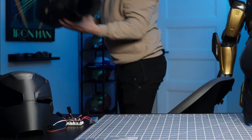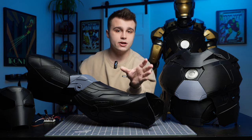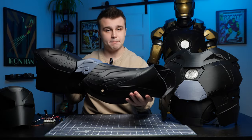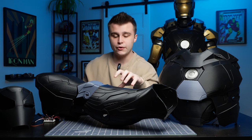The shoe covers have pretty much stayed the same since the last video, but the legs have changed quite a bit. The hinge that attaches the shin to the thigh — instead of using a double hinge like in the last video I ended up using a single hinging point. Now there's only one point where this knee bends, because back when it was a double hinge it would twist and torque in weird ways. Besides that, all the mounting points inside the legs are now fused to the 3D print itself. Once I confirmed the mounting points were good I fused them into the 3D model and printed it as one single piece, so now it's bulletproof.